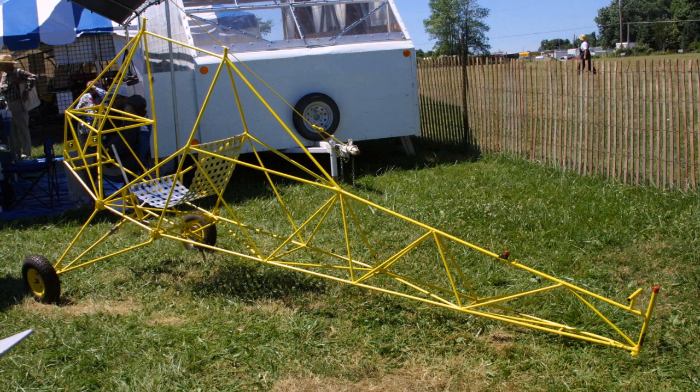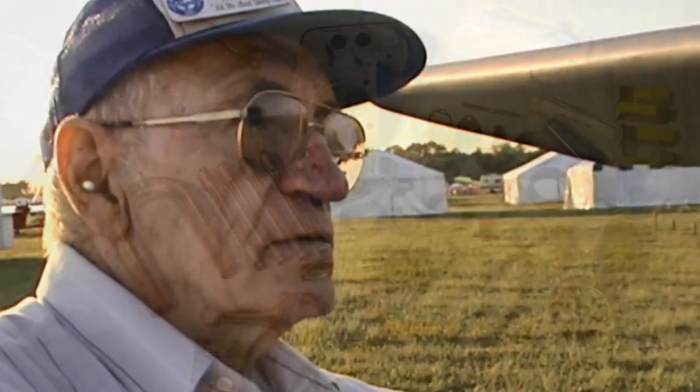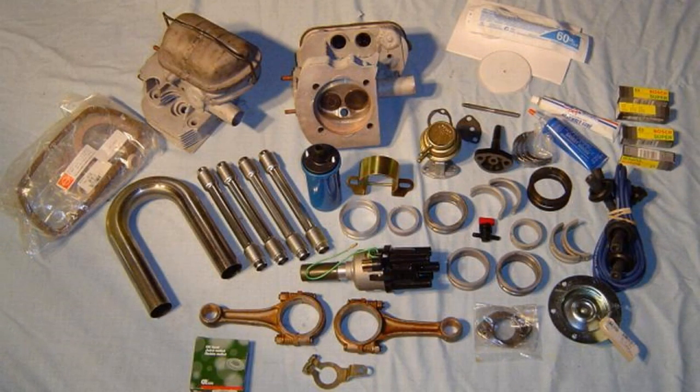Now, this airplane's a little bit different. It's got a welded fuselage. Yes, sir. And what kind of wing are you using? Well, we have an all-wood wing. It is very similar to a Minimax wing in type of construction and airfoil. It doesn't have the full-span ailerons, which I really don't care for, so I made them half-span. And it has an aluminum tubing tail with pop rivet gussets, the full-wood wing, and a steel welded fuselage. The Better Half VW engine on the front of it with this pair of propeller here.